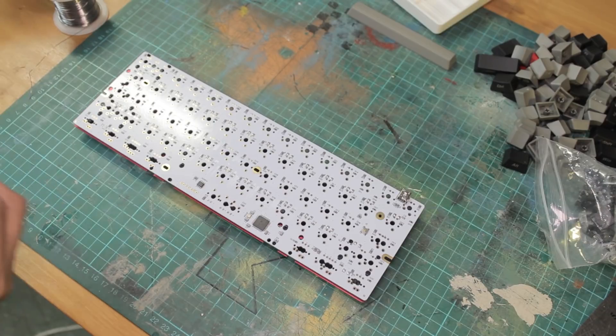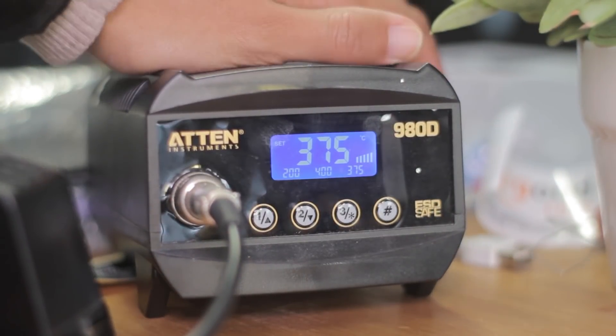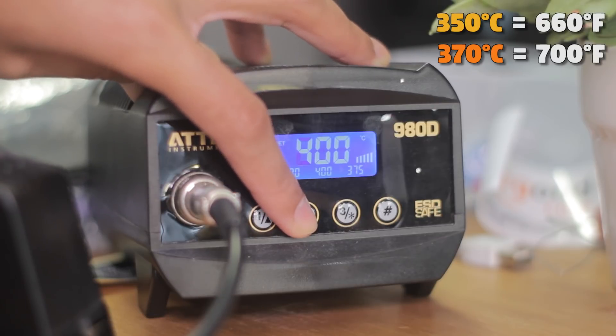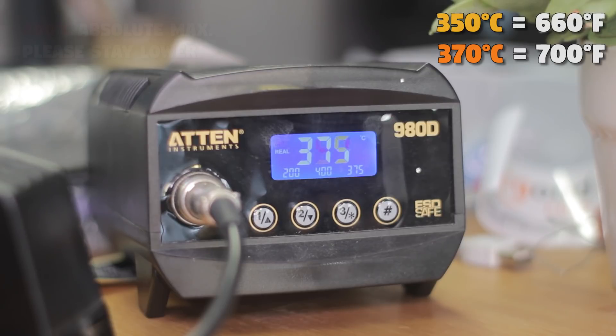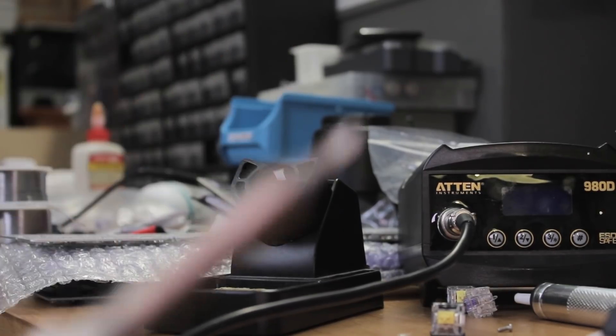So now to the soldering. This is the only thing that will prevent people from doing this besides the costs. We only need to do very simple through-hole soldering, but I absolutely recommend you go out and watch a bunch of soldering tutorial videos before attempting anything. EEVblog has a great in-depth tutorial, and Joe from Juju Cables will have a great video specifically about soldering and keyboards coming soon — I'll link those in the description. First we need to set our temperature. All stations are different, especially the cheaper ones, so find a low temperature where the solder melts. This is usually around 350°C, but I tend to go around 370°C, with 400°C being the max.